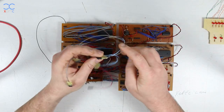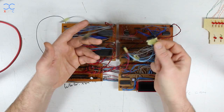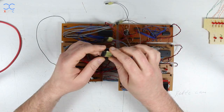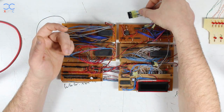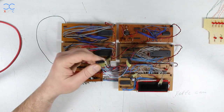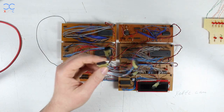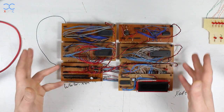I've put some hot glue to hold everything in place. One tip: if you want to make these wire connectors, the easiest way is to take baking paper with a non-stick coating, place the connector on it, put one side, then peel it off and do the other side. You can even shape it with a knife to make it nice and square.